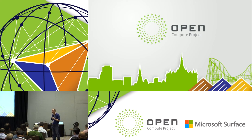Hi. You mentioned you use OpenBMC, but the previous talk, the server guy used standard AMI BIOS. So I don't know how they can work together. So there's a bit of delineation yet, right? Massive, large servers where the management requirements are heavier are still in the process of migrating. So you see AMI pretty prevalent across the servers. The newer, smaller management problems are more readily migrating to BMC. So when you look at our JBOD offering, AST2520 with OpenBMC, this FX, what we call FX16 offering, is migrated to OpenBMC. It's there easily.